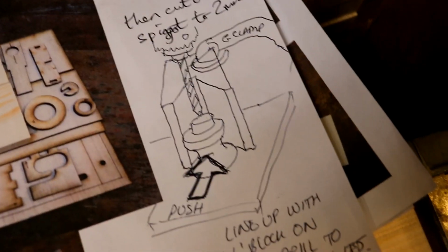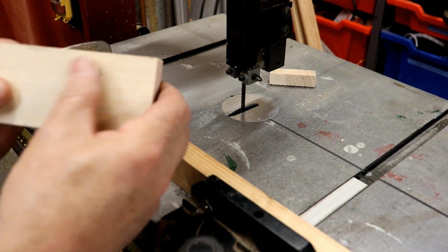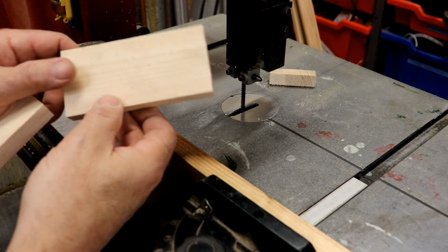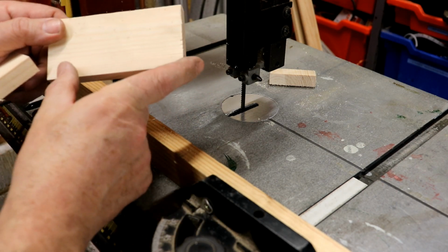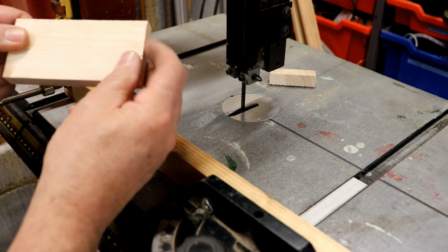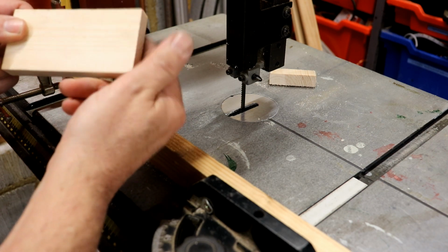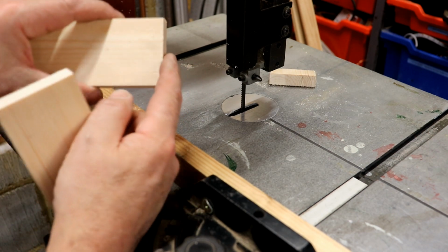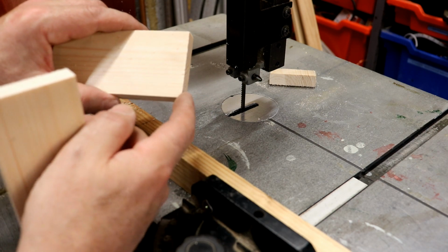Oh, that should remind me, with a bit of luck. In the past I've used the bench saw, circular saw thing with its right angle guide, to cut these lengths up perfectly. But I've only just got enough wood to cut these without too much waste where the blade goes. Is it a kerf? I can't remember now. Ridiculous, I used to teach it all the time. The circular saw, bench saw, has a kerf, I'll keep saying that, just check it's right, of 4 millimeters.